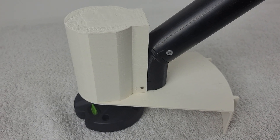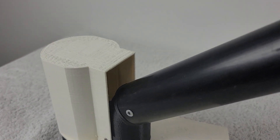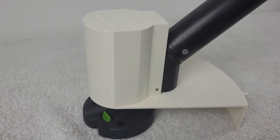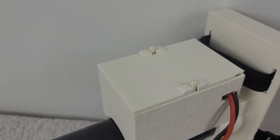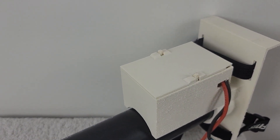Here we have our motor cover installed onto the motor bottom end assembly. The motor can still breathe through the back side, which should cover most of the debris that could enter in this area. Now we'll install the cap onto the top — it fits in like so, and to make it quick and easy to access, we have a couple of pins that can be placed into the holes, allowing it to come off with no screwdriver or any tools required. Now let's plug this into a 6S battery pack and fire it up for the very first time and cut some grass.